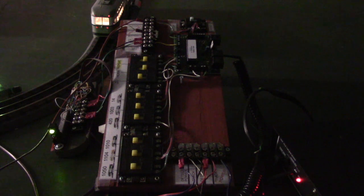And what's happening is it's starting at input 1 and going all the way down to input 30, encountering a half-second delay statement, and then it's going back to the top because the repeat switch is closed, and it's starting down the bottom again. In other words, we're going down through all 30 inputs inside this thing's memory, which is roughly 120 commands, 4 steps per input, but it's not finding anything to do other than blink that LED.